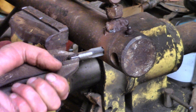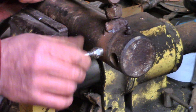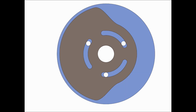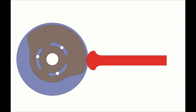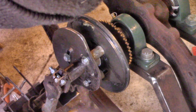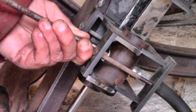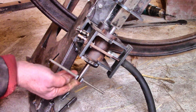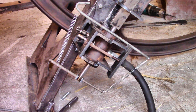I now have two valves which turn on the air and mostly turn it off again. Now I need to activate them mechanically in time with the piston stroke. I'm using cams on the main shaft — I made them so I could adjust them against a fixed plate. I spent quite a while trying to figure out the best shape and then the right size of these cams and the push rods that they activate, setting them up in the right place and at the right angle, and holding the valves in position while also allowing for some sort of adjustment. Then adding springs so the push rods return to base each stroke and the spool rods don't just stay out all the time. So it's all a bit fiddly and it took ages.